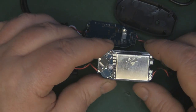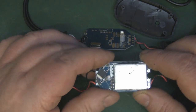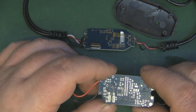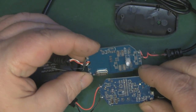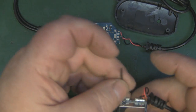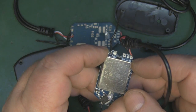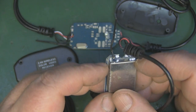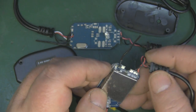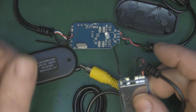This is the receiver and it's a lot different from the transmitter. There's a big voltage regulator again and a lot of the components are under a shielded can so we can't see those. There are unpopulated components on the underside, just like the transmitter. I'm hoping we've got enough room to add the SMA connector on this side. I may have to modify the SMA connector because of the shielded can - we haven't got a lot of room to play with, but there are ground points we can use, including the shield itself.